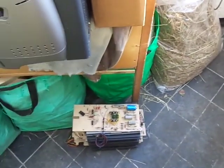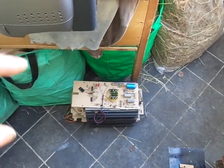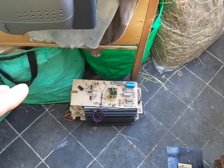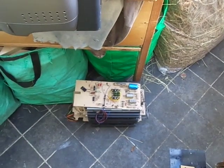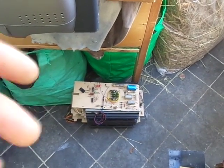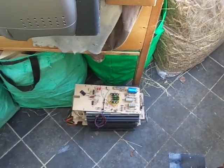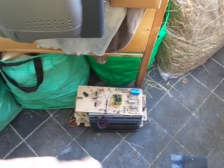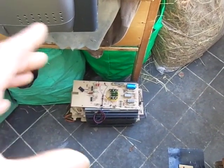Before I get to that, I want to say a little bit about this subwoofer amplifier. I've been on it about a couple of weeks messing about with it. Powered it up yesterday, found I'd made a couple of stupid mistakes, rectified those, tried it with a waveform of opposite polarity going into each channel. All I got out was a big sawtooth wave. I'm pissed off with the thing for now.